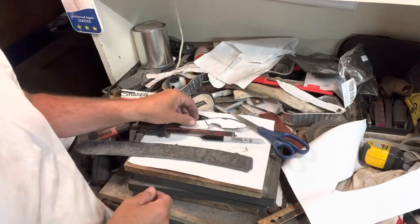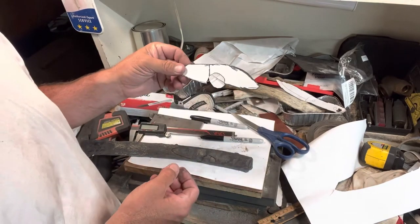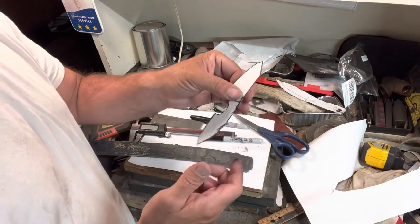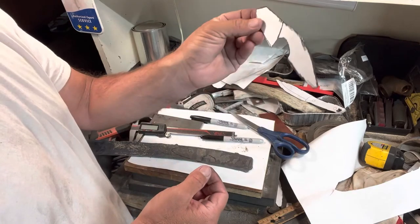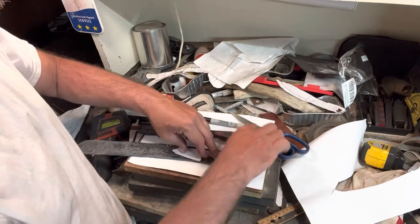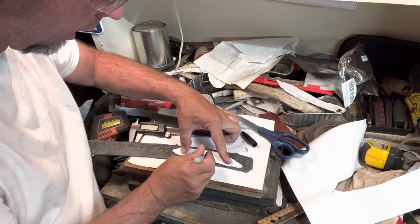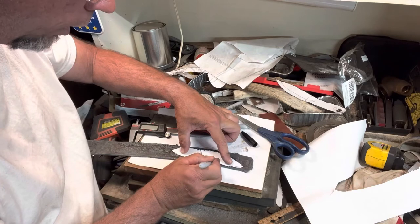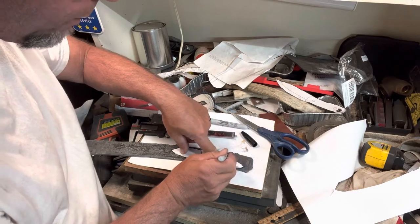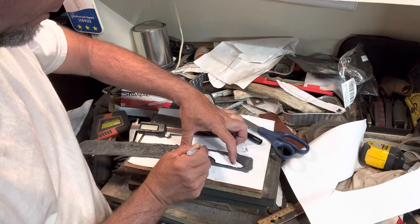Got it all drawn out, ready to go. I just sketched this together really quick — got a skinner that I've made before, similar to that. With this little sheep's foot type edge on it, I thought it would just give it a little different look. I'm going to do stock removal, which is basically just tracing or drawing an image onto your steel and then either grinding it out or cutting it out with a cutoff wheel, bandsaw, or something like that. I'm going to use a cutoff wheel and then the grinder to get the shape out of it.